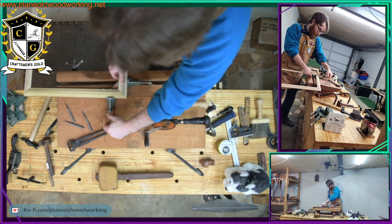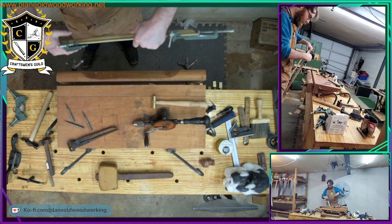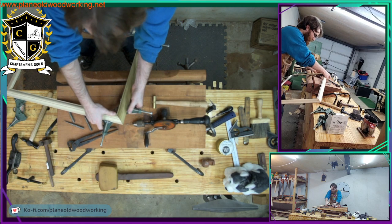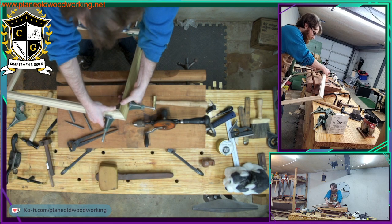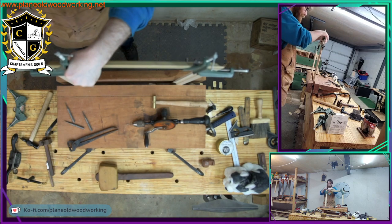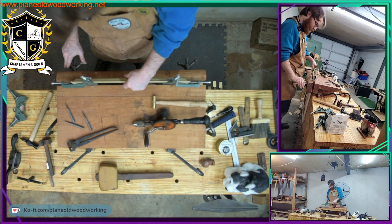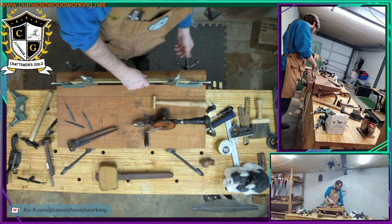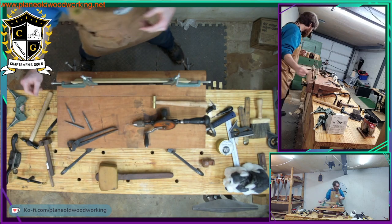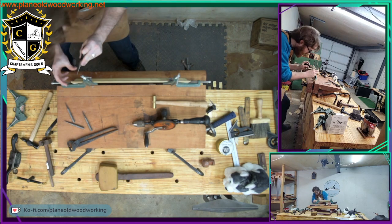And this is the side that's actually critical that gets nailed. It's not the rematch. We're getting her done. It was glued up. It took a while for me to finally get it stable to glue. But Payne, if you notice, there's no clamps on this side. We're setting in some reinforcement nails. Then we're going to either cut the back or sand the profile a little bit. Okay, just enough pressure to make sure it doesn't bounce. So right now we are just setting nails. Okay, we're gonna go ahead and make the divot on both of them.